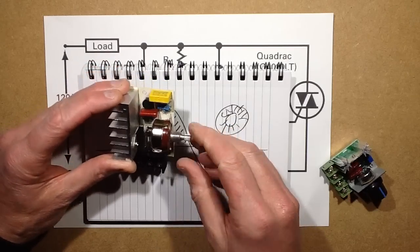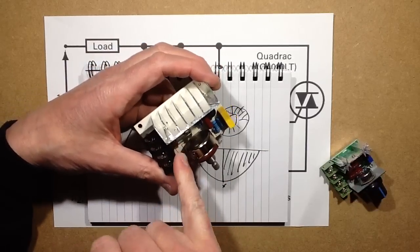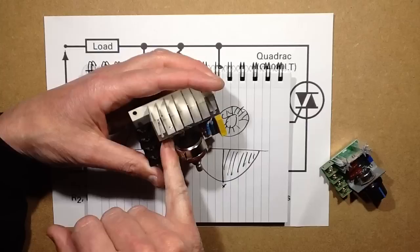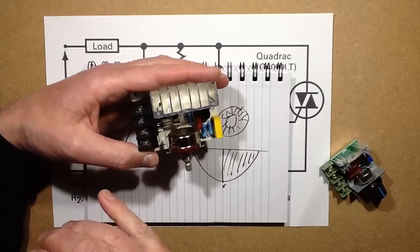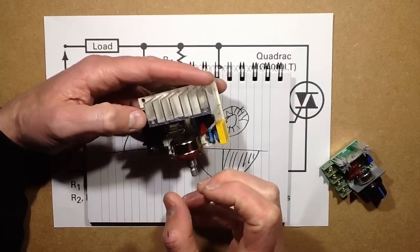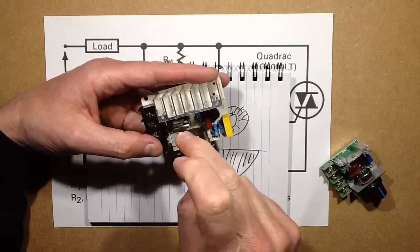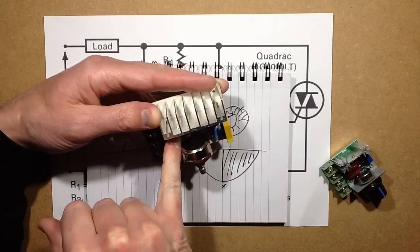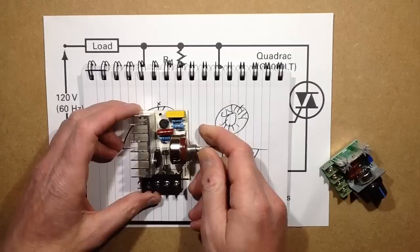The other thing I'd change is the fuse - I'd replace it with a ceramic one. Glass fuses at mains voltage are only rated to break about 35 amps, and a short circuit will be considerably more than that. A ceramic 20mm fuse is actually rated to break closer to 1500 amps, which gives it a much greater chance of actually breaking the fault current, because they have sand inside to help quench the arc when the wire breaks. That's a much better option. But other than that, it's quite an interesting little industrial unit.